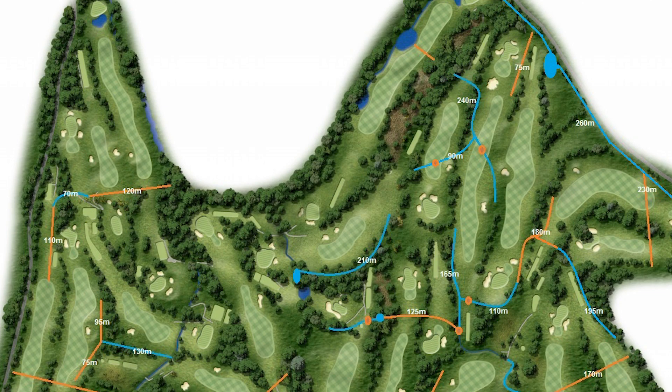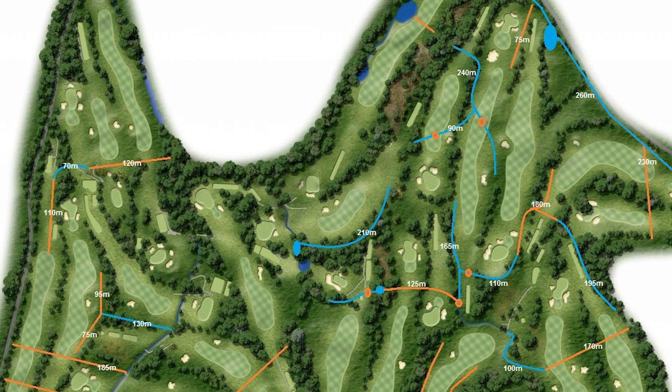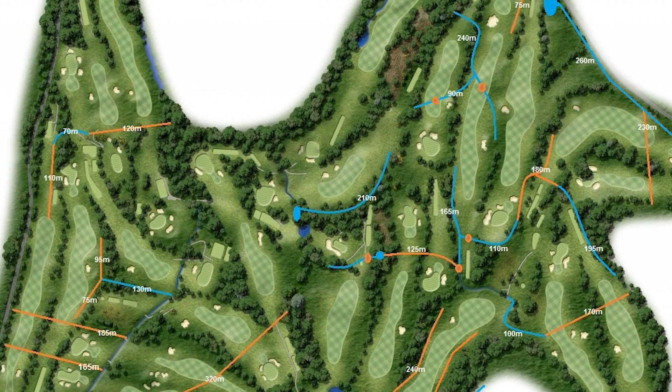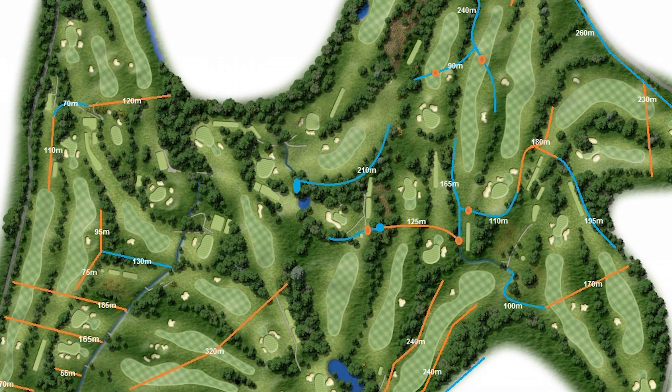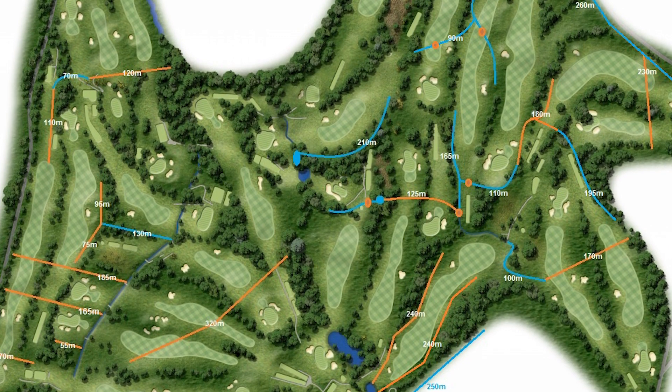After carrying out our site evaluations and using the data from the topographical survey, we built an arterial drainage master plan which you can see here. On this plan you've got blue sections which are a series of new open ditch networks, and they're tied in by the orange sections which are underground mains piping. We're confident that the installation of this arterial plan will give us the foundations we need for further future drainage work.